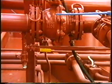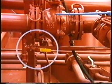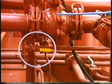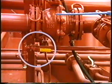3. Also open the stripping valve between pump and discharge line. Keep the stripping valve open for approximately 5 minutes to get rid of the air pocket or gas pocket trapped in the stripping pipe. This to avoid pulsation, vibration in the cargo pump.